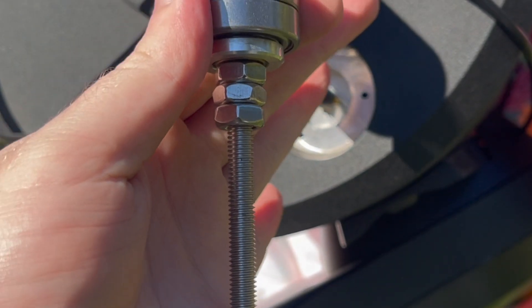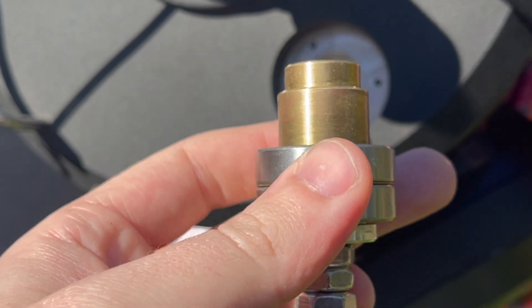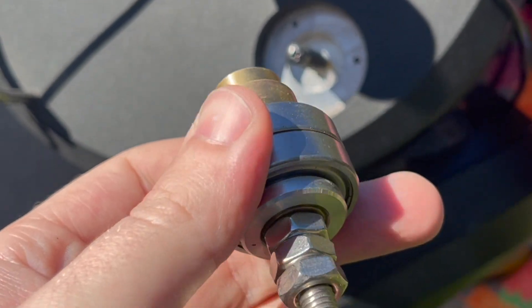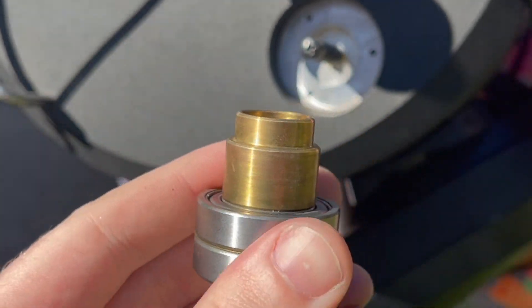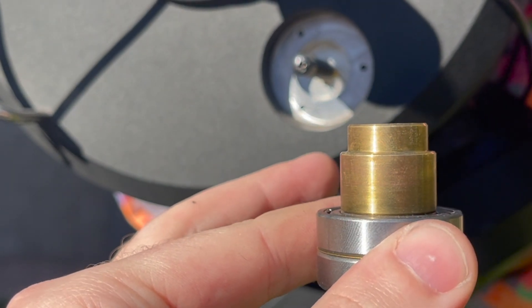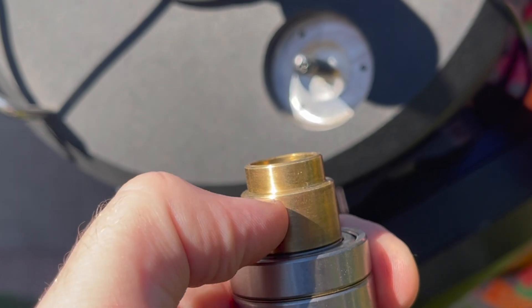I found a piece of brass threaded rod and put a nut on one end and a couple nuts on the other end — this is overkill, you can probably get away with just one or two. What I'm gonna do is chuck this up in a drill. Brass is really soft, so with this chucked up in a drill you'll be able to hold the bearing, run it at high speed, and hold a piece of sandpaper against it to take off just enough metal for it to slide in.